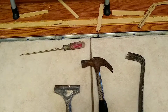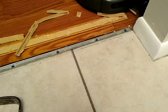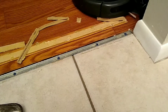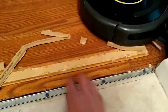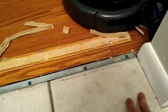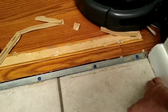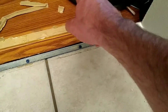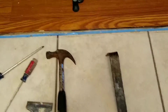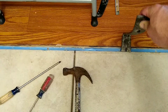I'm going to go ahead and remove that track because the transition piece doesn't look clean there near the baseboard. I'll bring the tile to about right here, and when I do that room I'll tile to here as well. Removing the track gives me a gap to start removing the tile, so I'll put the pry bar in there and just start hitting it with the hammer to pop it right up.